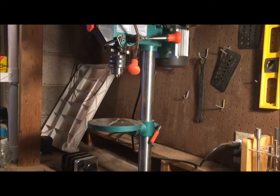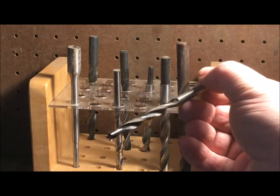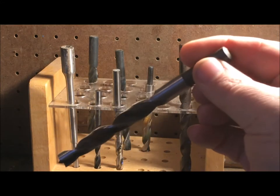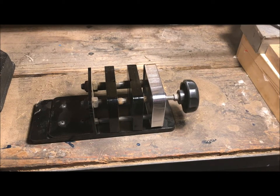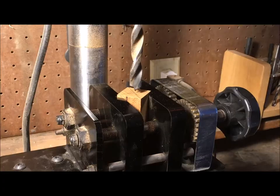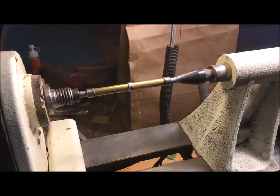The next big tool to consider is a drill press. You can drill your pen blanks on the lathe but it often requires extra tooling, and a benchtop drill press is not too expensive. Your pen kit instructions are going to call for a drill bit to drill a hole in the center — this one's a 7mm, the size of your mandrel and a good starter bit. Our kit calls for an 11mm bit, so just make sure to use the bit called for by your instructions. To drill my pen blanks I use a self-centering pen blank vise, though you can always cut a couple of V's into some blocks and clamp them together with the pen blank in the middle — the idea is just to keep your fingers away from the drill bit. To mark the center on your pen blank you can use a straight edge marking corner to corner, a center finding tool, or on a small pen blank it's pretty easy to find the center just by eye.